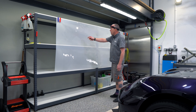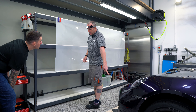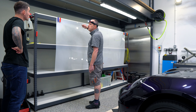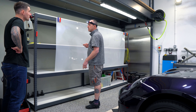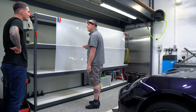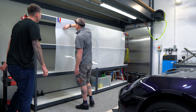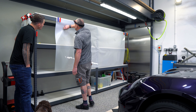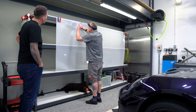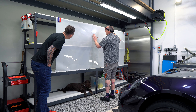Paul has done the lower part of the upper section and is just taking the excess off the top. As he removes the excess material, it exposes the pattern — you can now see what was on the computer screen. That point correlates exactly — it's going to come around, follow that shape, and dip in. If you finished it on the inside of the curve, there's a much greater chance of it popping out of the corner.